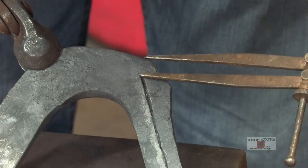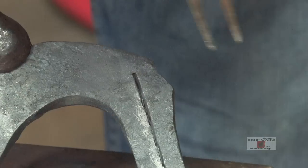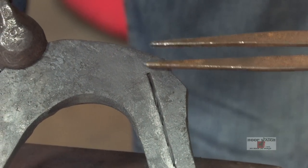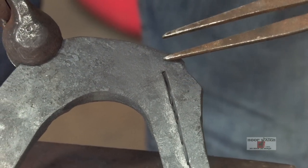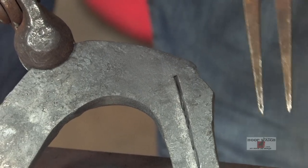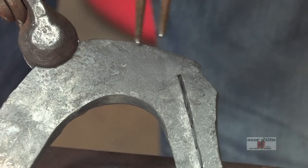If you look, I stop my fuller end at the same distance that I am in. So I move my fuller end in and I stop. And if I put my fuller end all the way up here to a stopping point, I cut it off. And when I say I cut it, I actually cut the material and I'm no longer allowed to forge the corner around and manipulate it.